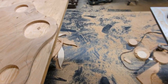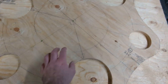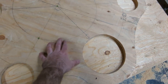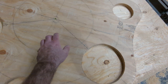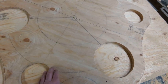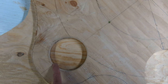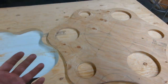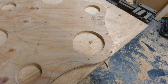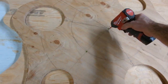I started with a piece thinking it might be the final, but it ended up being part of the process — and that's a win. This first piece became a pattern. I used a router pattern for the 8-inch openings since that's larger than a hole saw will do, jigsawed and used the spindle sander to make smooth openings, double-checked the pots would slide through, then routed the three larger holes and hole-sawed the smaller ones. I used the disc and spindle sanders to clean up the contour.